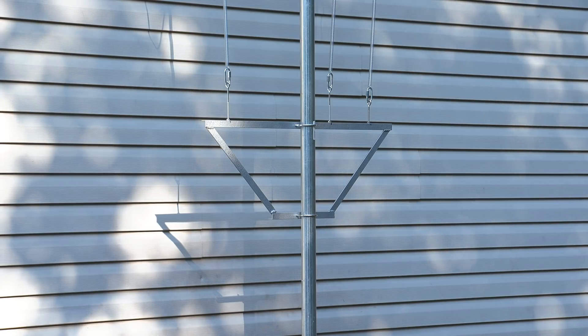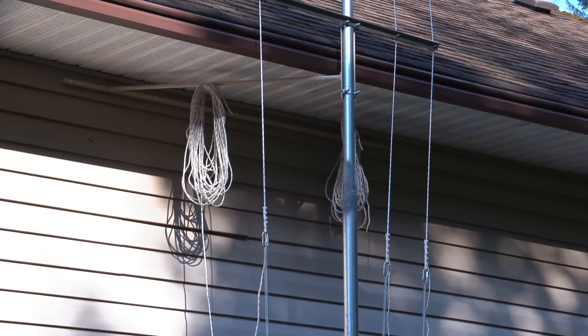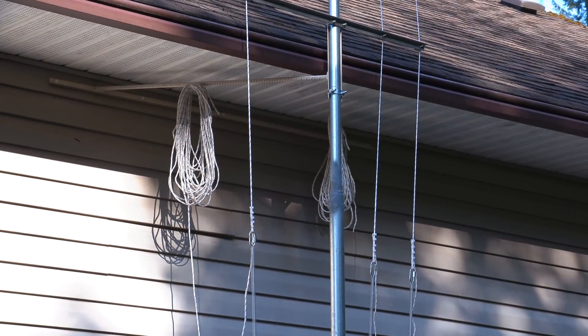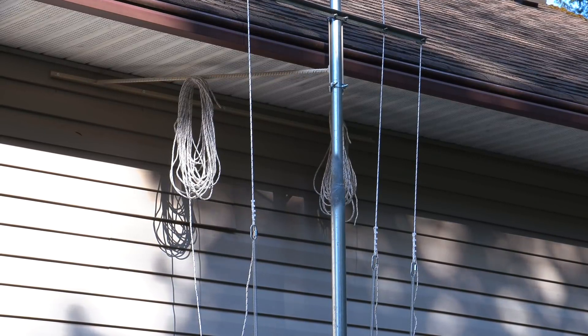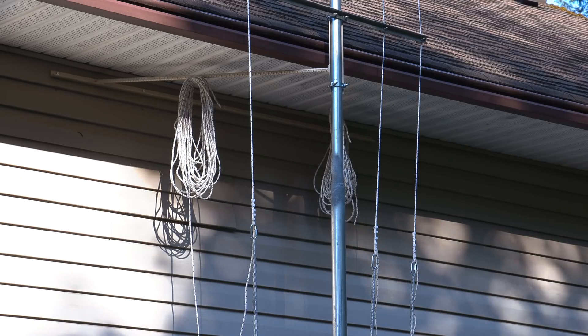The structure that you see on the bottom is what's holding the antennas tight. You'll see that kind of apparatus there and you'll see some springs. You'll see the springs here, and then the rope at the top — that's just the access rope running up to the top that's holding the wires tight. I'd like to trim that off and clean things up, but I really need to have it there because if I need to let down the wires, I need the rope to do it. It's just bundled up with a zap strap to the upper support there.